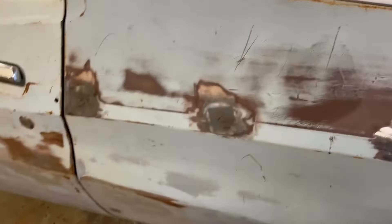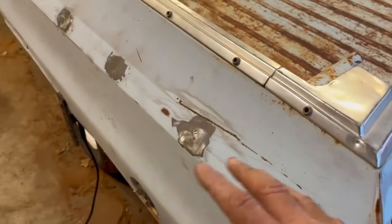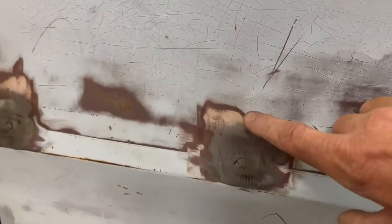All right, top side done — I'm about 30 minutes in on this now. You can get real picky with some of this, like that one I need to go a little further on. But a lot of that you can just fill in with body filler and primer and sealer. It's kind of dealer's choice — pick your poison. I will go back when the metal is not so hot and try to fill it in again with a little more metal, that way there's that much less Bondo — or body filler. My auto shop teacher always said it's not Bondo, that's the name of the brand.